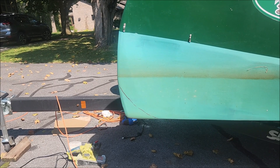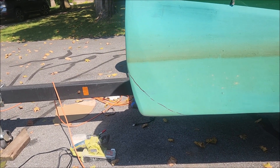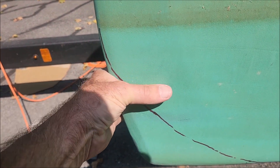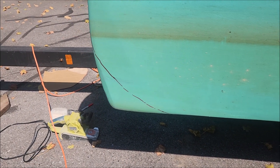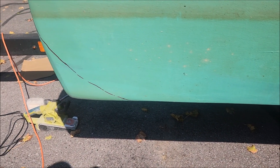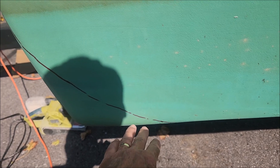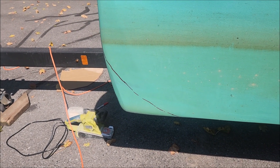I have the boat out of the water and it's time to start some modifications. This part of the bow is just too sharp — I get massive amounts of weeds bundling right here. I need to have a good angle to the bow, so I'll need to modify it and put more curvature on the bottom. I do have enough room for that because the original bow stem started further down, and a couple years ago I added another section thinking I could improve it.